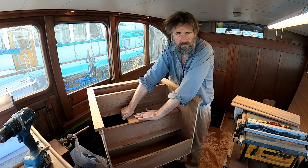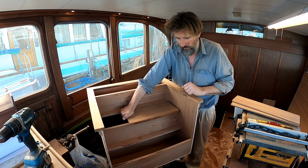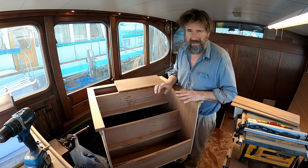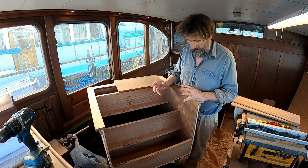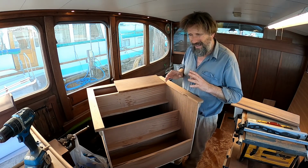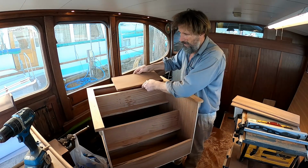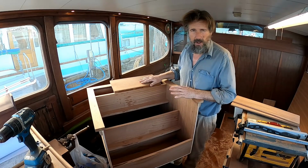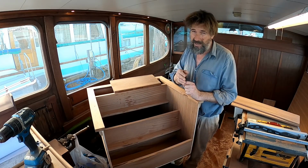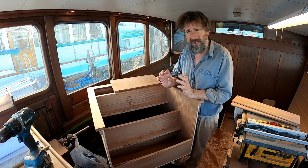Of course, a lot of the load when you're walking up a staircase is actually carried by the riser, but I might as well have the ends of each tread also very well supported. Now, this little piece of 3/8, it's actually going to be less because of some clearance. It could have been grain in this direction and it would be pretty robust. But I really like the idea of it being grain matched and just the extension of the same thing. This sapele mahogany is extraordinary, stable, fine-grained stuff. The prospect of cross-cutting a 3/8 piece of a step, it would just fall apart if it was many woods. But this stuff, it might just do it.